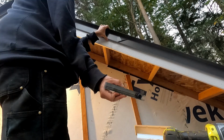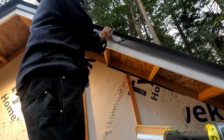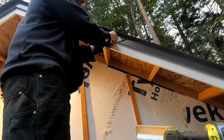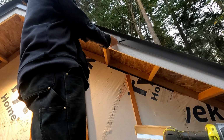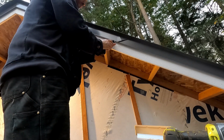Yeah, I'm gonna use my homemade rivet clamp here. These never quite want to nest as well as I want them to. But do our best to get this seated, and then I'm going to put a rivet. I'm probably going to put a rivet right where the old one was here just to fill this hole, and then I'll probably put another one next to it into sound new material. Just belt and suspenders it.